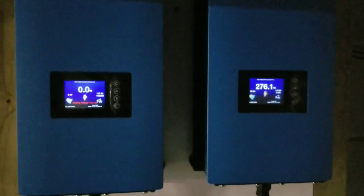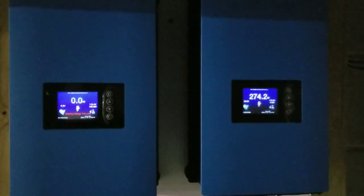This is how they work. You cannot just max them out because they have a threshold of only 950 watts. The furnace just shut off. I'm making some adjustments to compensate — I don't want the breakers to pop on the DC side. We don't want to run these at full threshold, just offset the power Dave is buying from the grid.